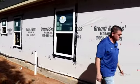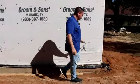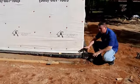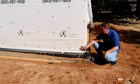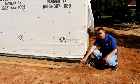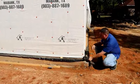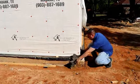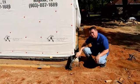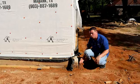As we're going along to the wall here, we want to pay attention to the bond breaker at the bottom. Make sure that the bond breaker is properly installed — you want it behind the vapor barrier so that when water travels down, it actually travels over the bond breaker through the weep holes. And you want to make sure that the corners are not uncovered, because the brick veneer will actually bond to the slab, and that's how you get corner pops.